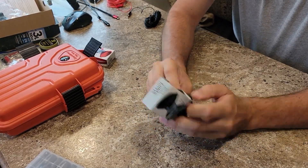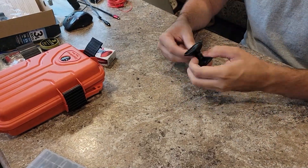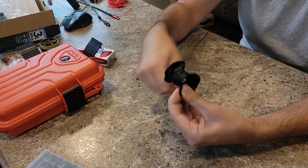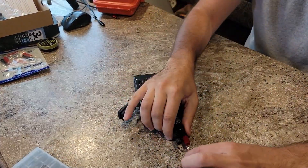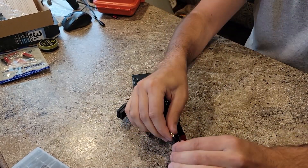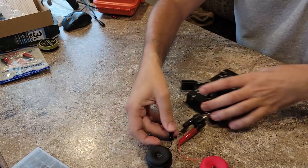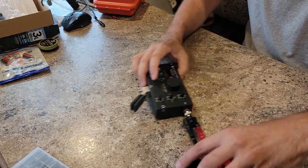Thinking fourth dimensionally, it would actually be really smart if I left the connector on the outside and could plug it into the radio and then walk away with the antenna element. So I've got to unwind all this wire again to get to the tail end of the cable. Let's test fit these things in the radio. It's a pretty snug fit, but that's exactly what we want — it gets a little easier over time. You want it to be just a little snug.